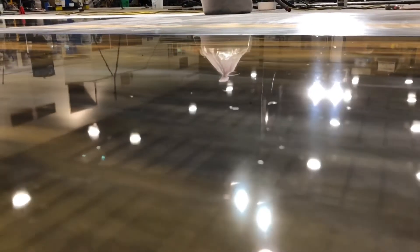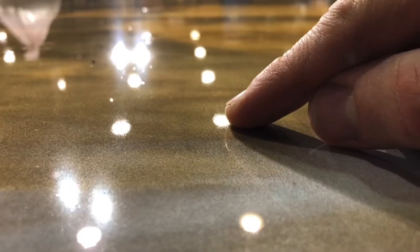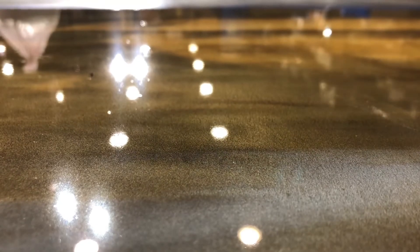In terms of visual clarity, the solvent-based urethane is without a doubt the best — it has the deepest reflection and terrific clarity. However, any imperfection is going to be very noticeable because the floor is so shiny. Tiny bubbles are easy to see, as are specks of dirt or debris that may have fallen in while it was curing. Though it has a great shine, it can be more finicky because every little imperfection shows.